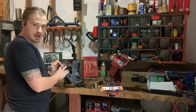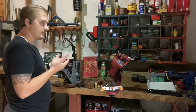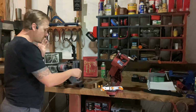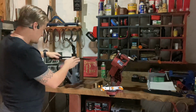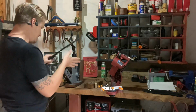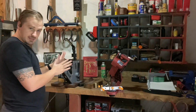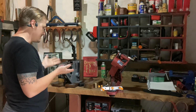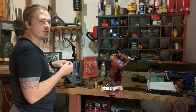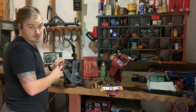So I'm always going to do edge trailing, which brings up the question of, okay, how do you remove a burr? Because edge leading removes that burr pretty darn good throughout the process. Edge trailing, however, creates a burr. And what that is, let's say you're sharpening this side, a wire edge will roll up on that back side, and more towards the honing process, you have to tease it off. Or, in this case, I'm going to show you a few tricks of how I remove a wire edge, just to get it a little easier. Because teasing it back and forth and back and forth and back and forth, it's tedious and it takes forever. We don't got time for that.